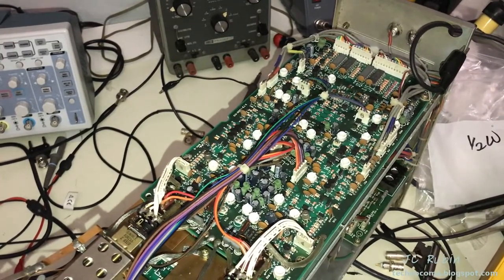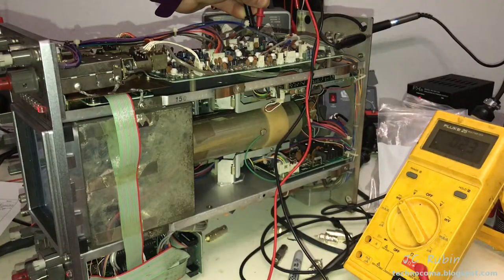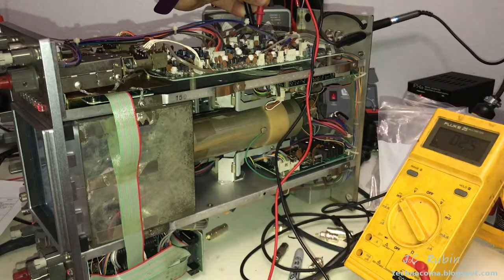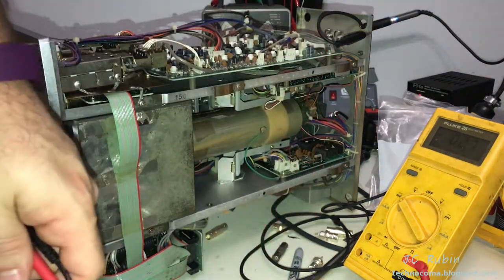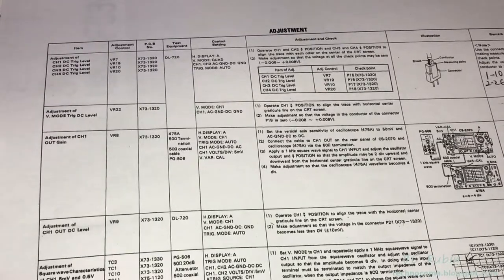With channels one and two being good, I'm going to conclude this test and move on. The next step is virtually identical except it's only channel one, measured on pin 19, exactly at center. It's showing 3 volts and within tolerance. I confirmed it by moving the knob on channel one, so that step is good. Moving on to the next step — this one requires close attention.